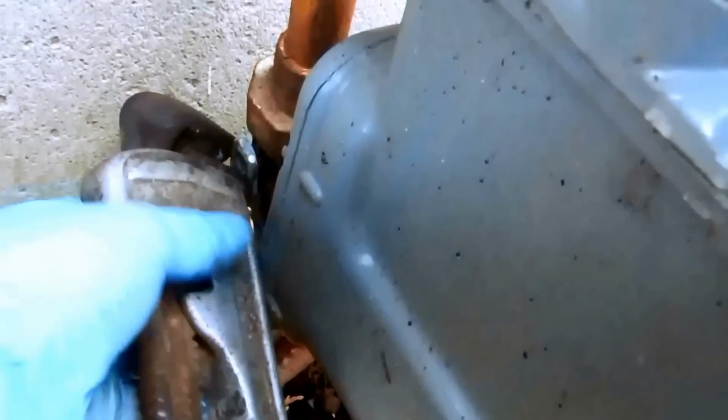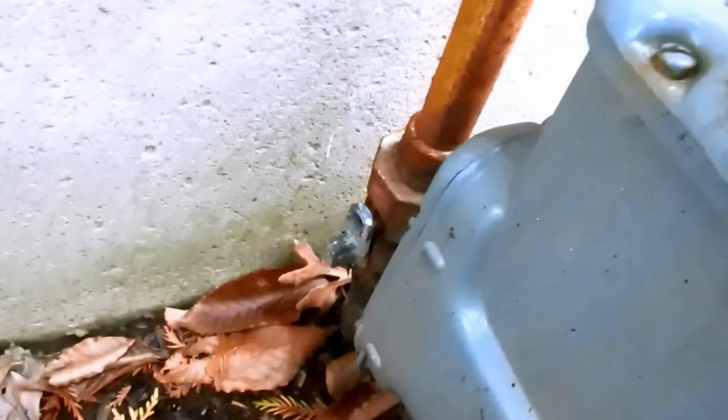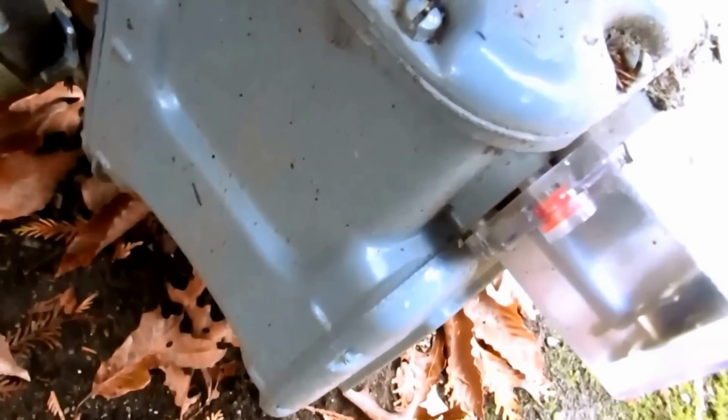Through here, get into this boiler room. I got gas right up here. They got 1 inch and that half inch line runs over. And it just runs over and it's dead ended over there, so I'm just gonna disconnect that. Tapping over here. So I gotta run that line up through. A little bit of work. Well, at least I have a shut off. There it goes.